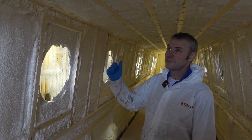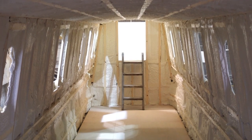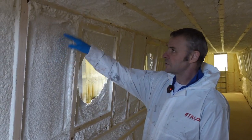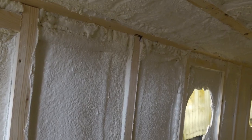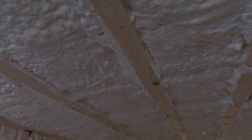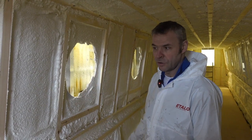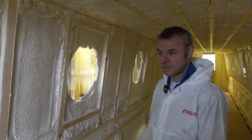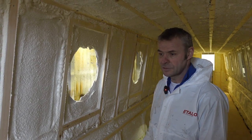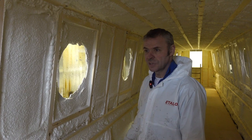As you can see, we've insulated with spray foam insulation - that's actually stuck to the steel and gets in all the nooks and crannies. So we've protected the boat on the inside with our primer and our insulation. We've shot blasted, we've put our first coat of high build primer, we've put a second coat of high build primer, so that's sealed all the fillers in. We've stopped any moisture getting in there.